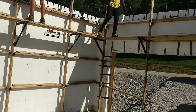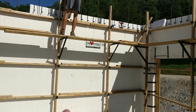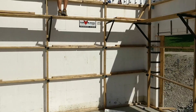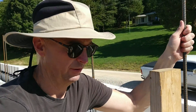You can see the wall scaffolding and bracing that we had for the walls — we left it up, took out the triangle bracing now that the concrete has cured. We are going to work on this edge piece right here. This edge piece is going to go up 10 inches, and the light deck is going to sit on the top. I'll climb up here and give you guys more detail of how this is going to work — the light deck will sit on top, concrete will go over the top and then down.